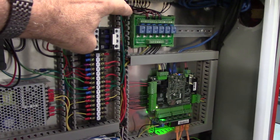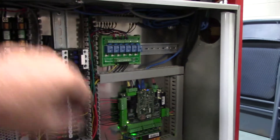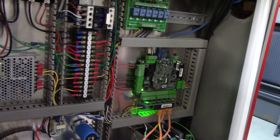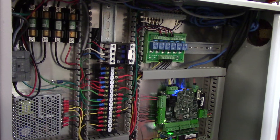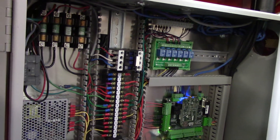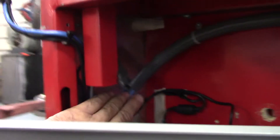I have my six-channel NPN relay board — this is a Revision 3 hardware Acorn board, so it did not come with relays. That relay board is controlling the Huanyang GT VFD. There's the conduit that drops cables down into the cabinet, and I've got a conduit here just to get entry for the ethernet cable and the e-stop cable out.